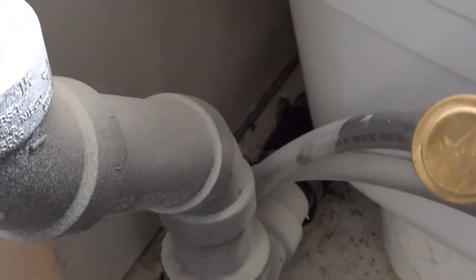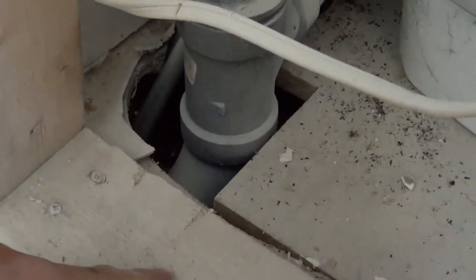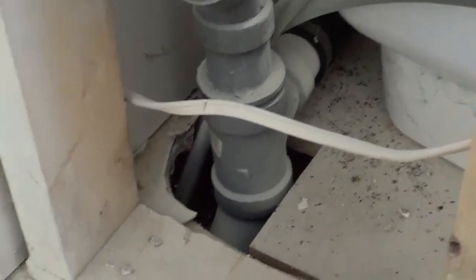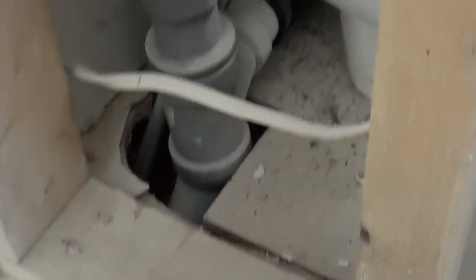And it comes all the way along the floor, over to the center drain there, where there's a P-trap right below the center drain. And this pipe here goes up to the vent there. So this little T right here is pretty far into the floor here. A lot of times what they'll do is they'll put it right in the wall right here, and they'll tee over. So sometimes this tub is easier to change from a center drain into a left-hand drain, or whatever side this wall is on yours. Sometimes this is on the opposite side, making it a right-hand drop.